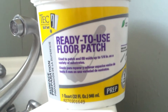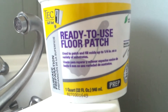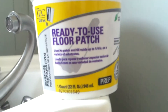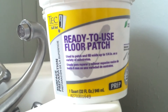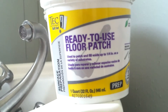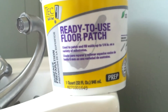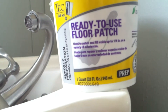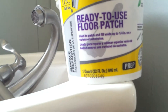See this stuff right here? A lot of people don't know to use something like this on wood subfloors, because sometimes when you're replacing subfloors — especially in mobile homes when they use that OSB board — and then you try to match up the thickness, OSB does expand over time depending on how long it's been in the home. So what we've done is try to match the subfloors close to the one next to the one we're going to be cutting out and replacing.